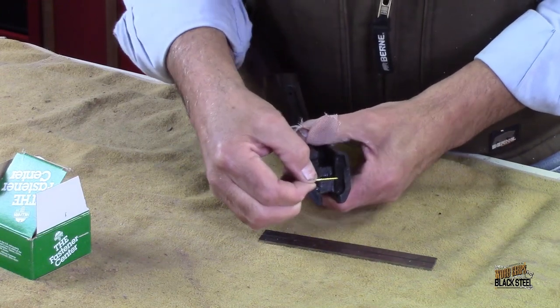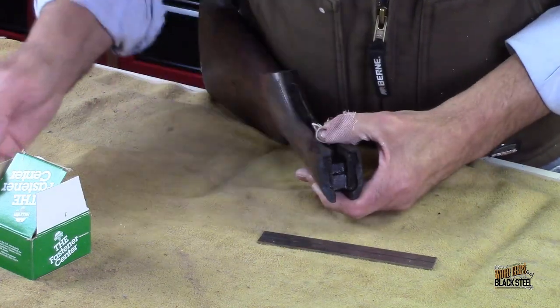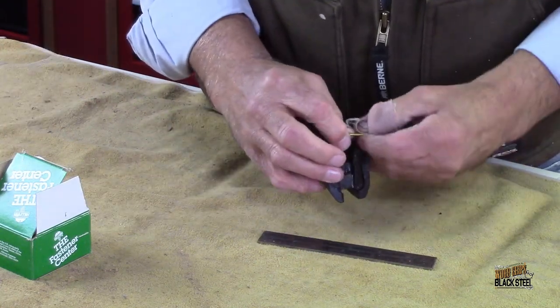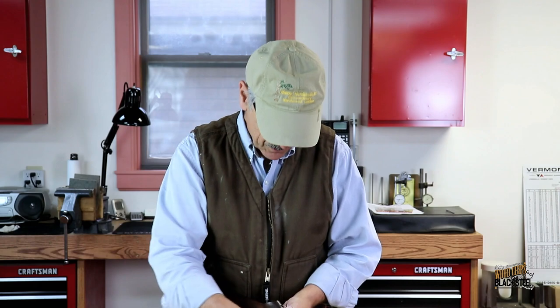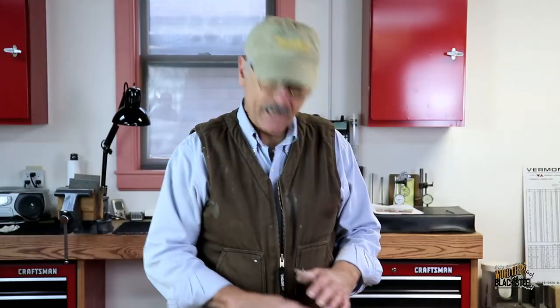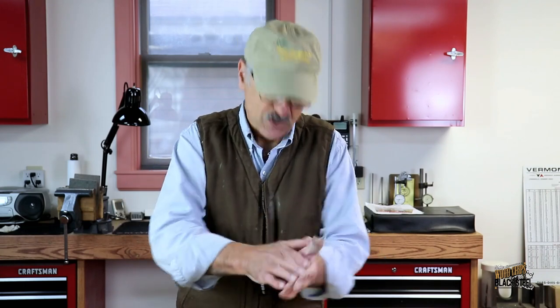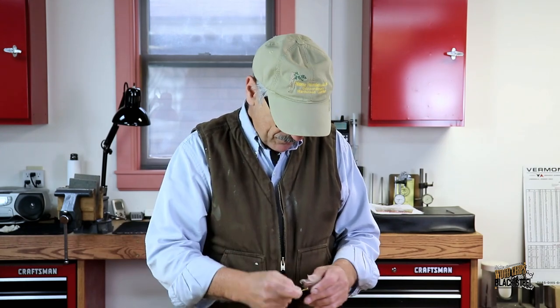And I'm going to come in from both sides, I think, and put a screw in from this end. And then another screw in from this side. The epoxy's holding up really nice, but I want to just give it a little bit extra strength by adding these screws. So I want to mill the flat off first so that I get a nice flat surface that I can glue the appliques to. But below those appliques, I want to drill and counterbore for these brass screws and then get those in so that those are hidden below the applique.